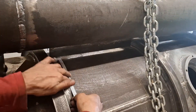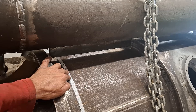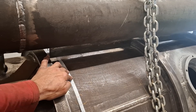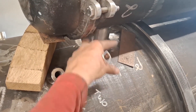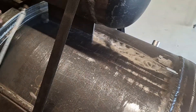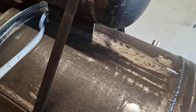So there's quite a bit of measuring here. I've measured from the middle of that rib down to here. The arc segment should be 281, and as I've found, I'm actually at 283. I've taken that as a pretty good win — the discrepancy of 2mm has probably come from drilling the hole at 281 and then the grinding moved it slightly. And on the other side, to the weld seam, it's 283 again. So that's correct.